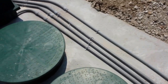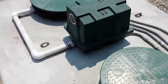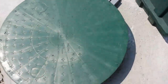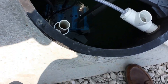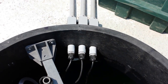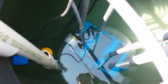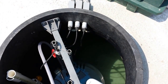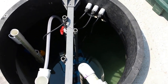We install these to a degree of more than what a septic would be — really what process piping would be — because this is a permanent solution for wastewater disposal. If we look in the area where the BioBarrier is, we can see three separate conduits: one for each float and one for the BioBarrier pump, which you can see below the water, with connections outside the tank. That saves on real estate inside the tank and means no gases can get back up into the control panel.